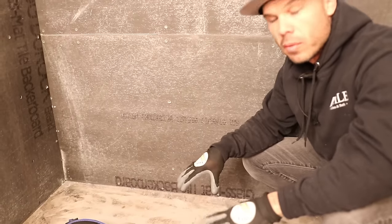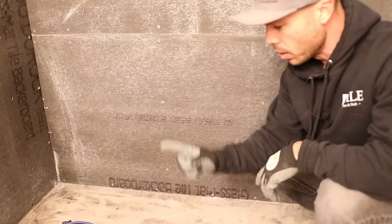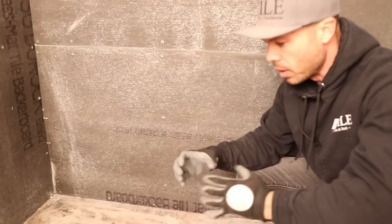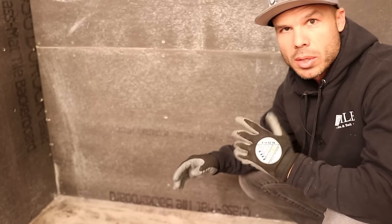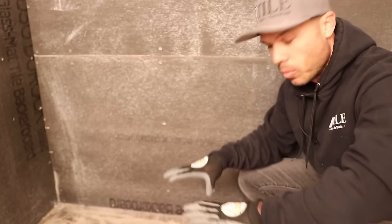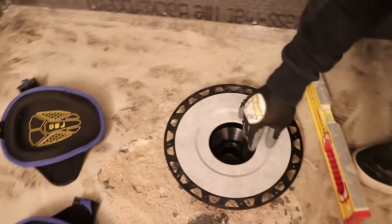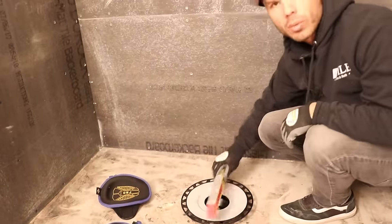This might also be different if you're doing it on a raised foundation where your pipe is just supported by straps. Underneath all this you got your ABS pipe, and then it goes into a trap. In concrete this thing's underground, so that pipe doesn't have any give — it's solid. But when you have it on a raised foundation, crawl space, or second story, that pipe might have some play and you might need to use your mud to get everything where you want it. But the ABS cement is really set up now and this thing doesn't want to move.